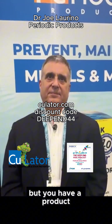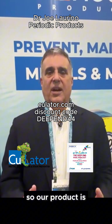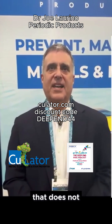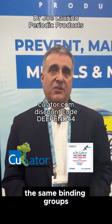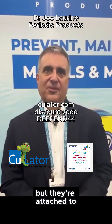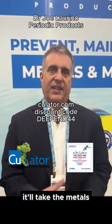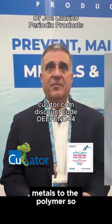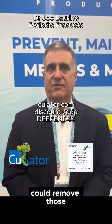But you have a product that removes metal — how does your product remove metal? Our product is really a sequestering agent bound to a polymer that does not actually dissolve in water, so it's like plastic. It's the same binding groups that are on the liquid materials, but they're attached to an insoluble plastic. As the water passes over it, it'll bind the dissolved metals to the polymer, so we actually can remove those kinds of materials.